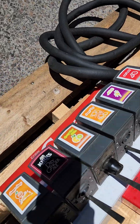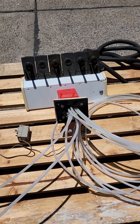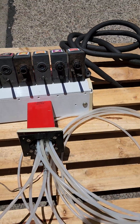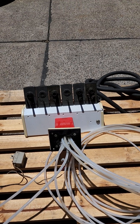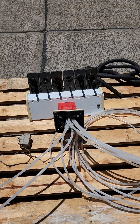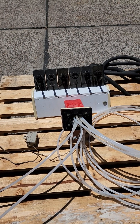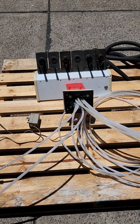These are preset, but we've preset them a couple of times now and they're not staying preset. The one we're having the most issue with is the orange fizz — it just keeps coming loose. We may end up having to replace the head on it if it keeps doing it. But I can talk you through adjusting it over the phone with a flat head screwdriver — it's fairly simple. If it's putting too much syrup in when you get it, that's pretty much it for the head.